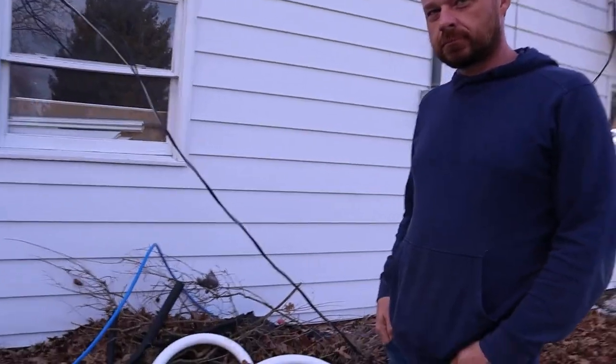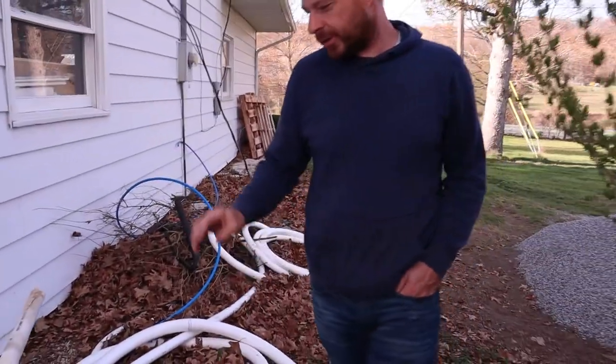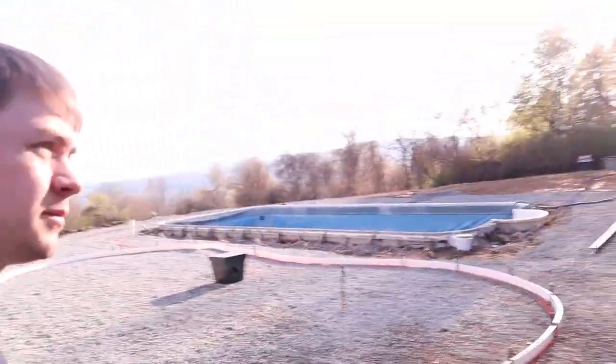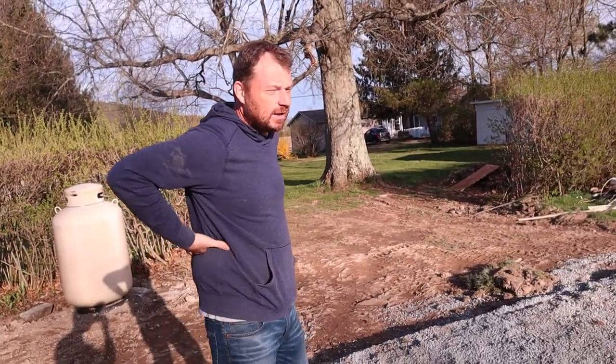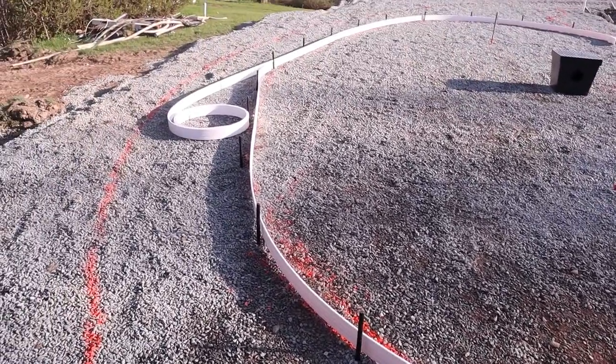Since the fixture video, we ran all the new plumbing — it's terminating right here for now and we'll tie it into the pool room and the new equipment inside the garage. Over here we leveled up the pad and brought it up to grade, about eight inches below the pool level to give room for the plumbing and the splash pad concrete. We put some pins down, marked out the layout, and laid out the forms so the sun will straighten them out.